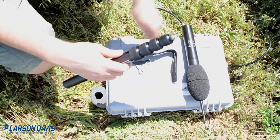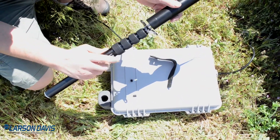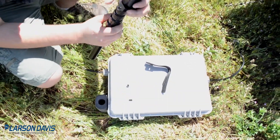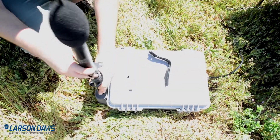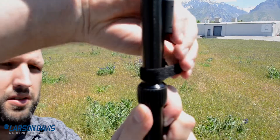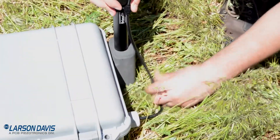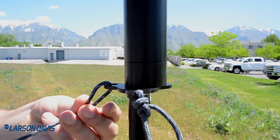Place the guide wire ring on top of the pole. Screw the pole into the EPS-2116, ensuring the cable is between two mount points. Twist the cable around the pole twice counterclockwise, then mount it into the case clockwise. Extend the pole and secure the cable to the pole using the three hook and loop straps. Steady the pole with the three sets of guidelines and stakes.